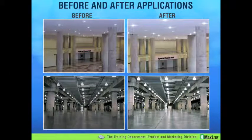What you see on the top side on the left is a 100 watt metal halide. We were told that these lamps were relatively fresh and on the high side, not even at the mean lumen point. The after shot is a 40 watt HiMax. This was more than 50% savings.